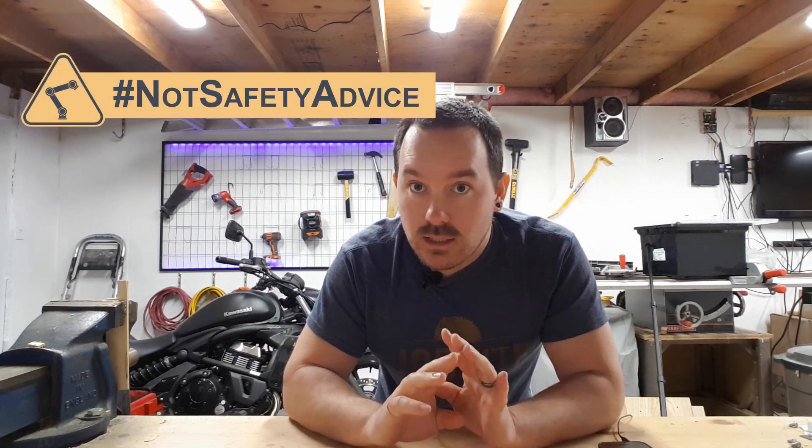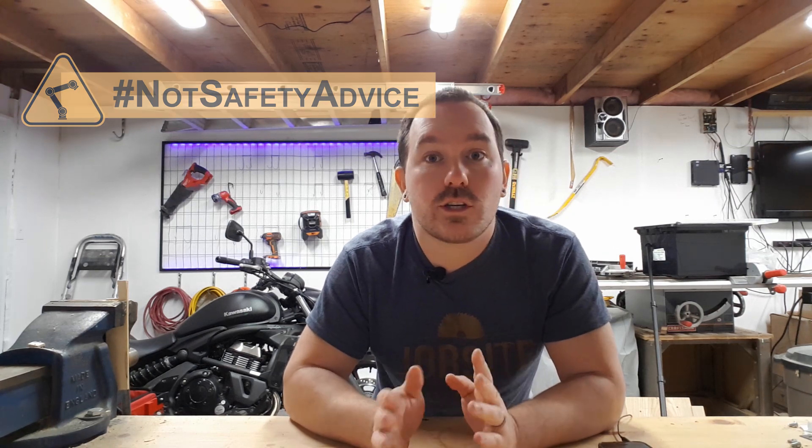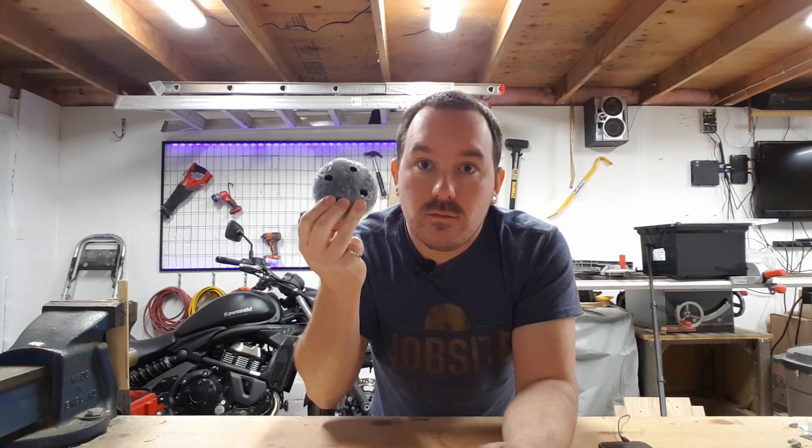A lot of you may look at this and immediately assume it's unsafe. And good — you should definitely be thinking of safety when you're working with robot arms. At first blush though, I would say that this is safe. This is not safety advice; do a proper risk assessment if you're actually working with a robot arm. First, Herman can't reach your head or your neck, which are the two big risk areas you need to be watching out for, and Herman can't even touch those. Also, the safety limits on the arm, because it is a collaborative arm, are set well within the safety that you would expect for a robot coming in contact with a person. Your back is also a reasonably tough area of your body. I do have the robot avoiding the spine, but you can't just assume that it's not going to go there — that's why I have the nubbin as wide as I do, just to make sure that even if it does hit there, the force should be well low enough to be safe. Also, it can't touch your butt.